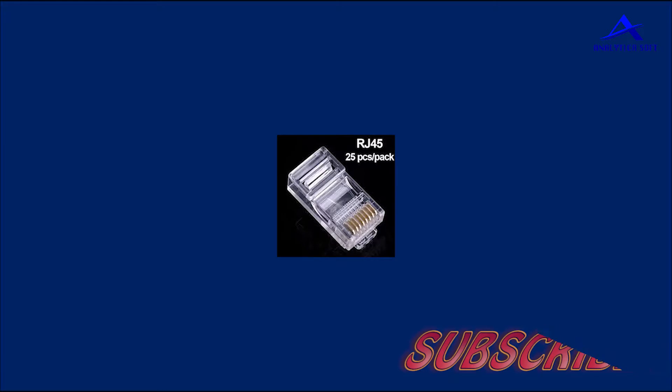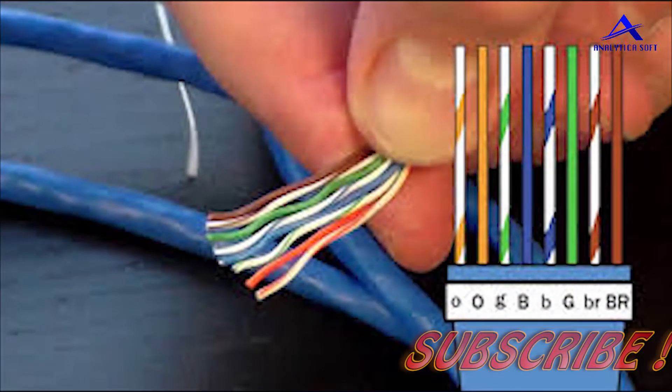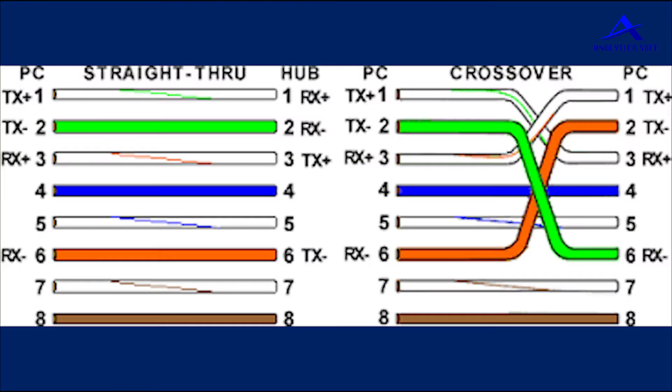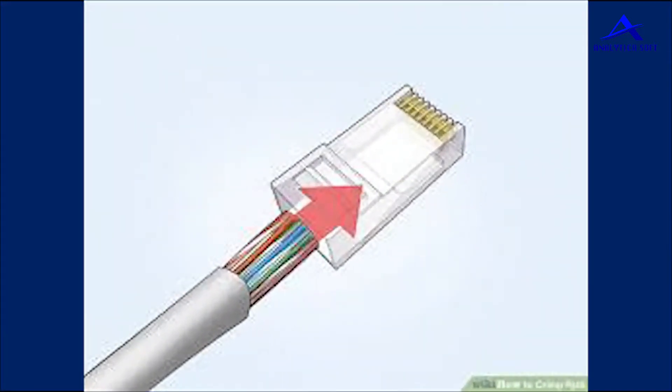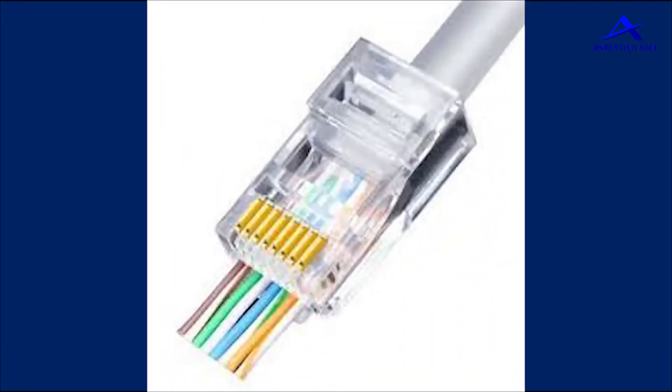With the clip facing toward you, hold your wires in the correct manner. Insert the wires in the correct order into the RJ45 — this is the crossover where the blue and green wires cross over each other. Do this carefully until you obtain an image close to what you can see on your screen. When you view it from above, you should be able to see the wire arrangement clearly.